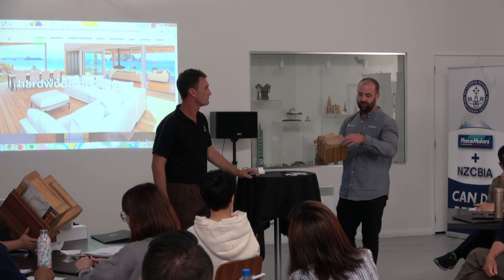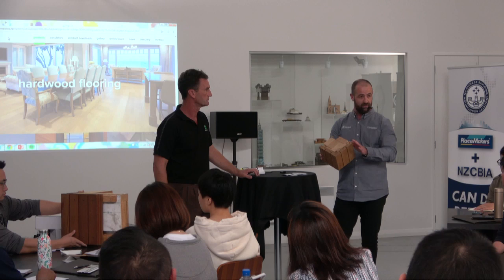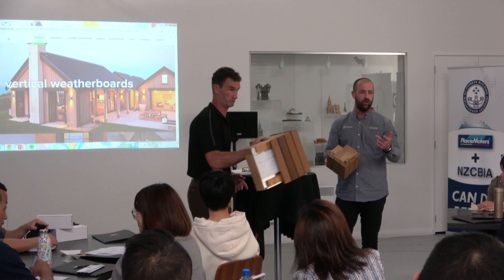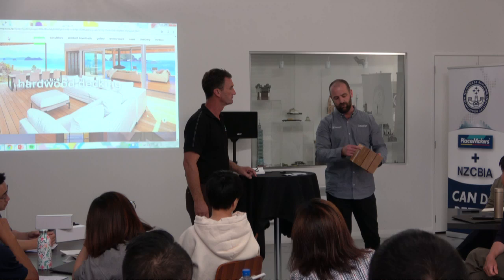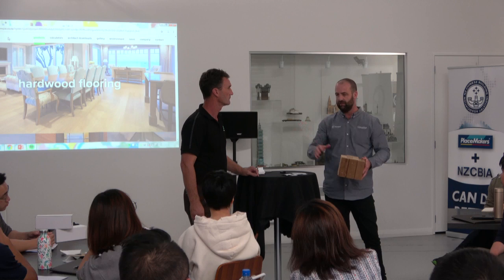You also need to order, as Hamish just said, the flashings. These are aluminium flashings. So we stock the cavity battens and the flashings, which we have in 75mm, 90mm, and 140mm. The clinch nails, and the fixing nails. So these are the things that you want to be ordering for vertical shiplap. For the horizontal, you need everything bar the battens; you can use your own pine batten, for instance from Placemakers, because that's a different system.